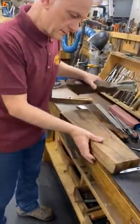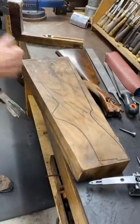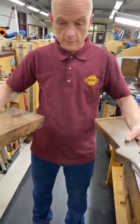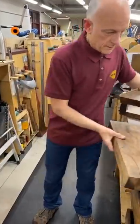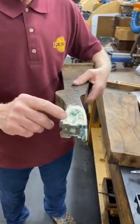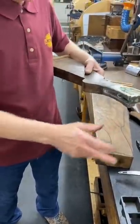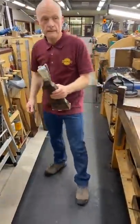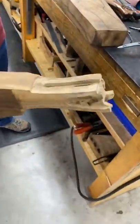Talk about the wood later on, but we'd roughly cut that out to the dimensions we require, bend and length. And then we're using a pantograph machine, so the pattern and the stock are connected together. We're tracing around this with a stylus, and using a cutter that's smaller than the stylus, we're reproducing this on the blank, but leaving about, I think, metric now, half a millimetre everywhere. It's really rough as well when it's actually done. It's nowhere near. So it would come off the machine like that, basically.